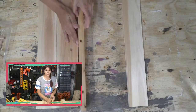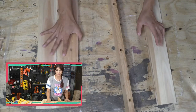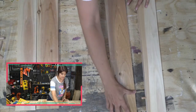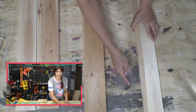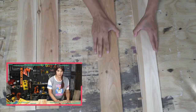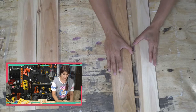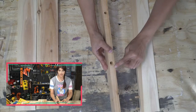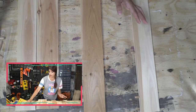And then you drill matching holes. And how do you get the holes to match up? Because that's always the toughest part. The way I used to do it was I would put the dowel in like you want, and then use a little paint, whatever color, and just dab a little paint here. Then you bring the two pieces together and try to be as precise as possible and meet them up like this. That causes a little dot of paint on the matching side, and that's where you know to drill. So that's pretty easy.